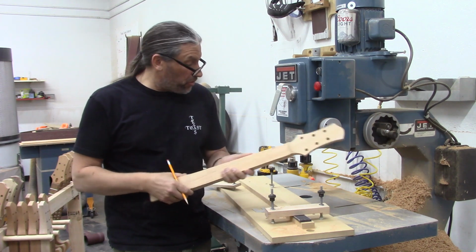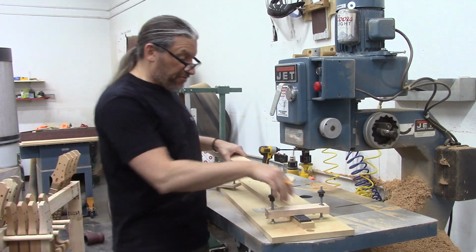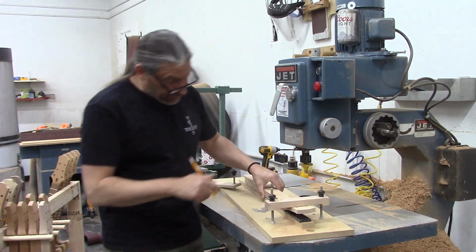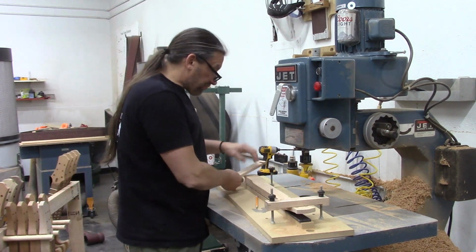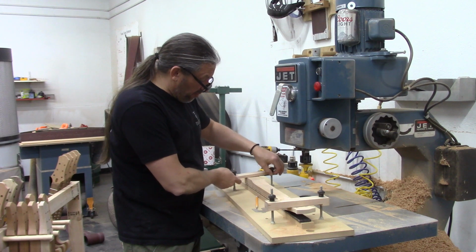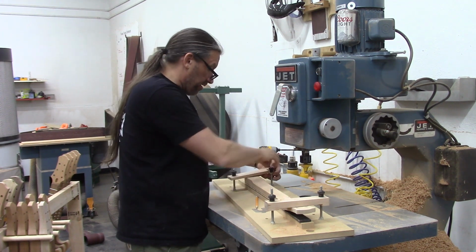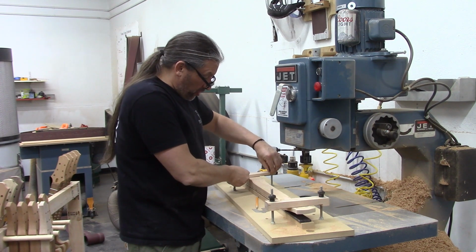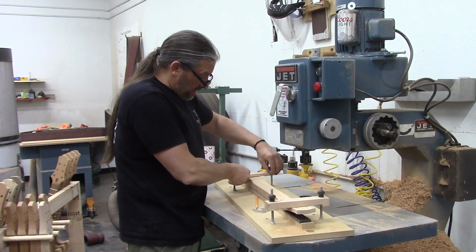with the power tools. So, you guys have seen this jig before. It is just a sled that holds our necks. And this is a 7/8 roundover bit here in the beloved pin router. And we are going to impart the 7/8 roundover to this neck.